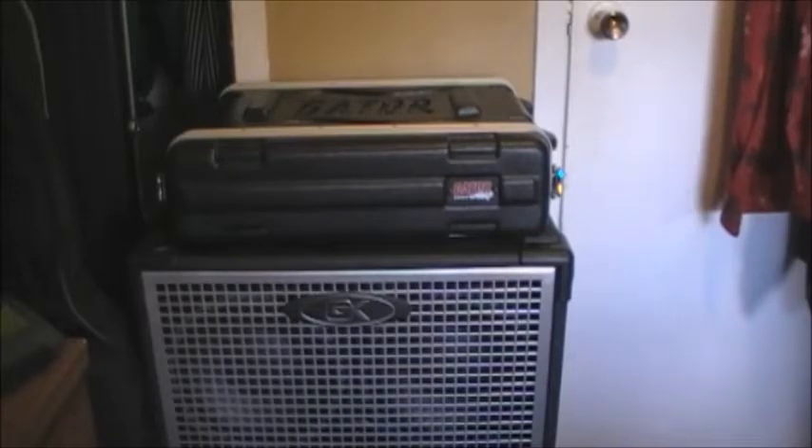What I want to do today, most importantly, is take off the grill and have a look at the internals of the cabinet by pulling out one of the 10-inch speakers. The cabinet is only 68 pounds but it's a phenomenal cabinet — beautiful sound, nice and tight, no unwanted resonance. It's mostly due to the speakers they're using, but also the bracing. The kind of bracing and the size of the cabinet — what they call the Q of a cabinet. The bracing, most importantly, is what I think makes this cabinet work for its size and weight. It sounds like a much heavier cabinet.